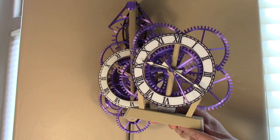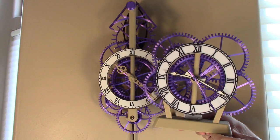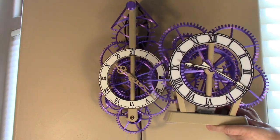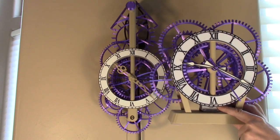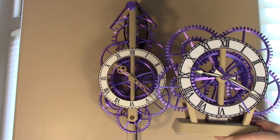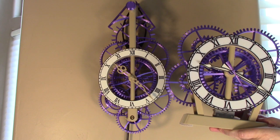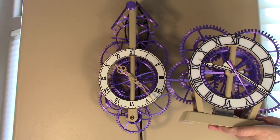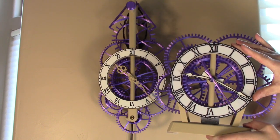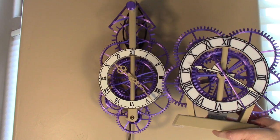I've also been designing a family of desk clocks. Here's the largest of the desk clocks — it's actually a similar sized dial as the wall clock behind us, but a different style of clock design. It uses a stepper motor commonly used in 3D printers, relatively cheap, and an Arduino Nano. The beauty of this is you never have to wind it, and it achieves an accuracy probably within 30 seconds per month, which appears to be relatively stable. I have a little bit of work to do before I can release this design, but it will also be a family of clocks — the large style, a three-quarter size, maybe a 50% size. I'm not sure how many versions will ultimately be released.